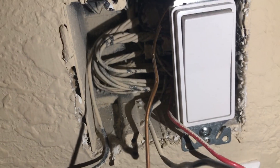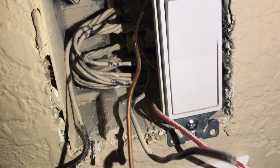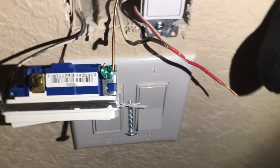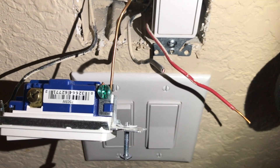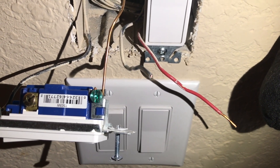Back to the box. After testing all the wires and figuring out which was the building line, I took the building line out and looked at the box. I know it's the line because it goes into that bundle of other black wires in a dual gang switch — actually a quad gang since it shares the box. So I know that is the line coming into this switch. Since I'm on the main side, the red is a traveler to the other side, and the black also travels over. One of them goes up to the light — I need to study the three-way switch wiring to confirm.